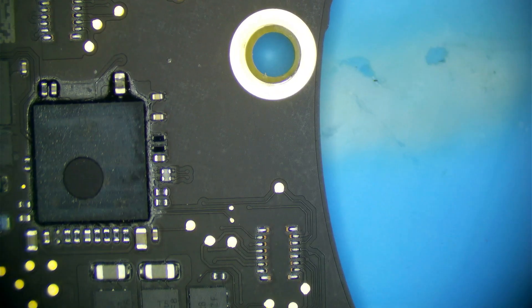I want to do a visual inspection around the chips — sometimes we find little bits of corrosion. The user denied any history of liquid damage, but of course everybody lies about that, so it's not off the table. Looking under the scope, this side looks pretty pristine — the board is clean.